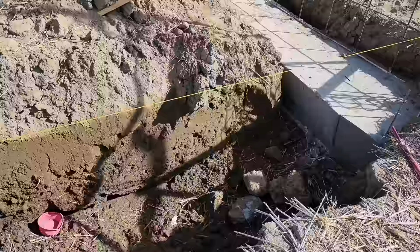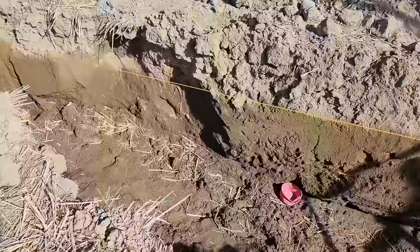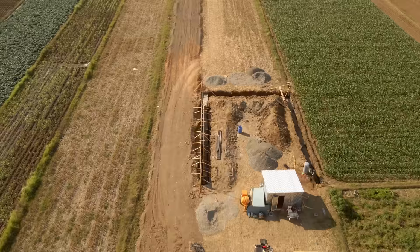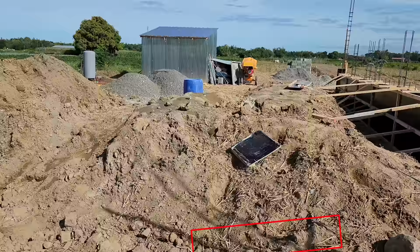And you can see down here the ground line at 110 centimeters, and we literally packed gravel all the way up there. Layer by layer, I just kept running that plate compactor. So this is the last wall that's going to be done over here. We're doing the three walls first, and we're going to leave that one open for now so we can get materials in here. That'll be the last wall that we dig, so I can start bringing in gravel, or they also call it backfill, so I can run and spread the backfill out.